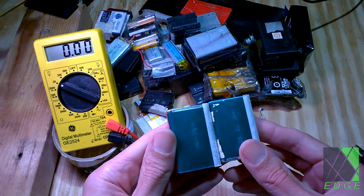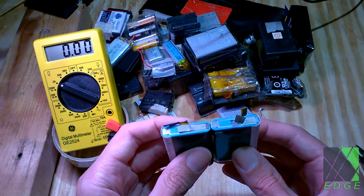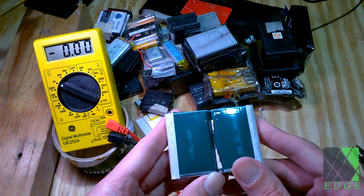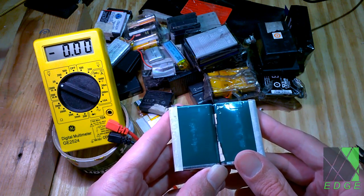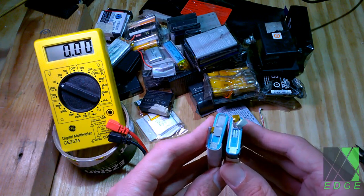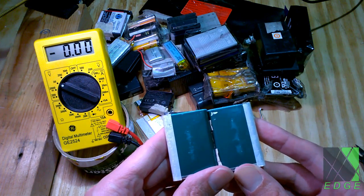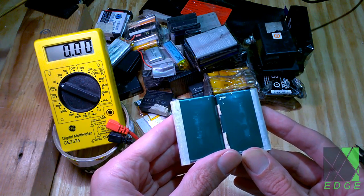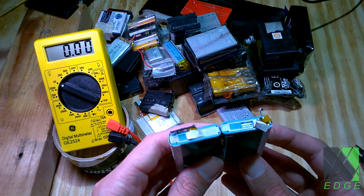The next phase of processing for the batteries would be to put a charge into them. If they're dead like these, just put a small charge into them — 10 milliamps or so — let them sit and observe their behavior. I'm going to charge them up to around 4.1 volts and let them sit. I'm not going to cycle them or look for the capacity. Once I've processed all the cells and find they're holding a charge, I'll leave the batteries on the shelf charged to about 4.1 volts, let them sit a week, and keep notes.